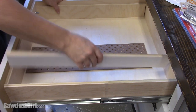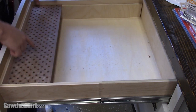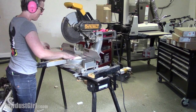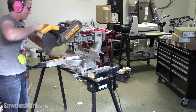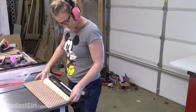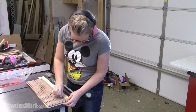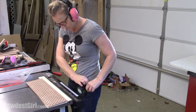I put little cleats in the side of my drawer so the bit storage can slide on top of them. I checked the width to make sure it was the right size before finishing it off. I used a piece of quarter-inch plywood cut to the same size as the bit storage piece, then cut little strips of that same plywood to put around the perimeter, creating a little pocket so the bits can seat down without falling through, but secured deep enough that they won't wobble.